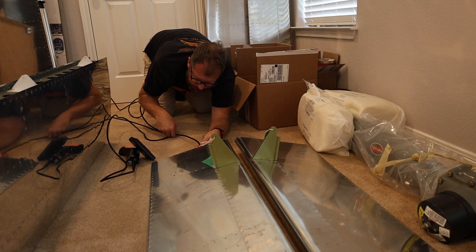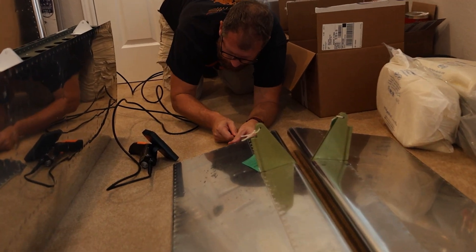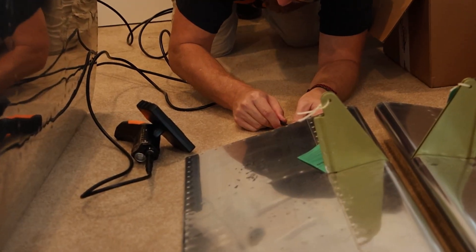I've been sticking my borescope camera into these wings, but I still haven't done a full inspection on the main wing body. We did see some very small cracks on the dimples in our flap assembly on the forward spar. And you can't even see inside the ailerons — they're completely sealed up. I'm assuming both the forward spars on the ailerons and the flaps are on the red replace list.